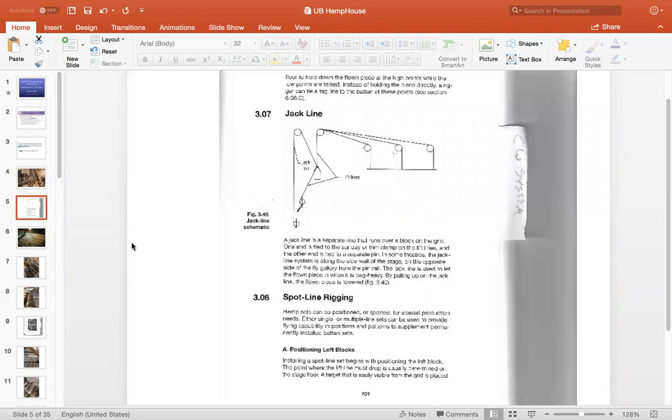So you have a batten sometimes. At the Geary Theater, we often did not use battens. That just added weight to the system that you had to counterweight. If you didn't need a batten for hanging a drape or hanging lights on, then oftentimes we would just bring the hemp straight down to the piece we were going to fly. So if we're flying a hard flat, we would bring it through the D-ring at the top and then tie it to the D-ring at the bottom and trim it that way and not have to add the weight of a batten from which we hung it.